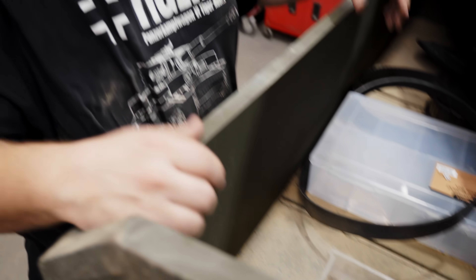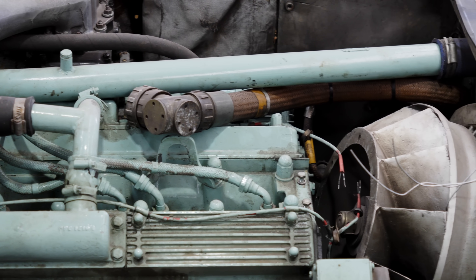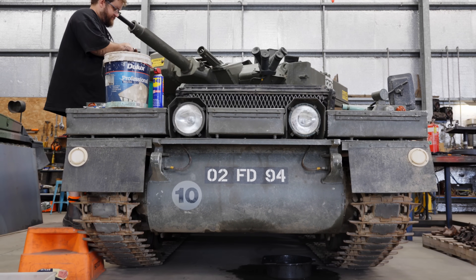This is stuff I've had to take off just to find out what's wrong with it. The initial problem was it's got no drive — none at all. It doesn't go forwards, it doesn't go backwards. However, it would still neutral steer. We need to find out what caused that. I sort of half suspect some bearings might have failed, and it just broke from there.